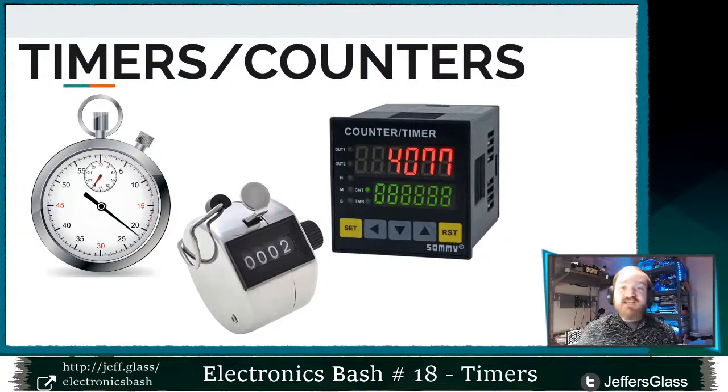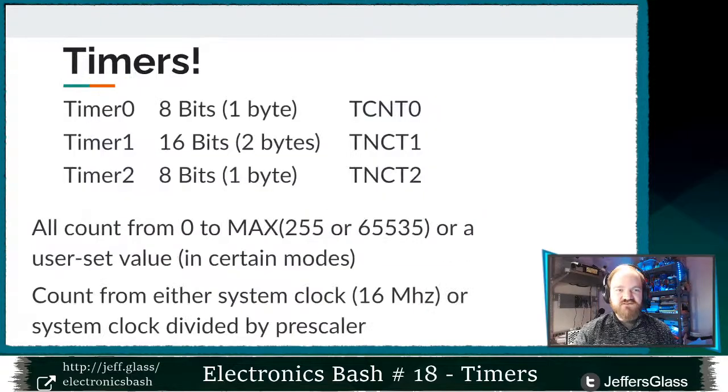We can also use these same counters, this same pile of numbers, when we're not triggering them in a regular metronomic fashion. They could be used to count individual events that are coming in from the outside world, and they'll work just the same. For our purposes tonight, we're mostly going to be using them with a regular, metronomic source, a source that acts like a clock. So same thing, just two slightly different ways of using them.